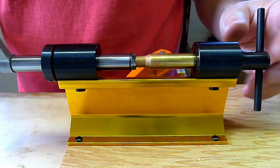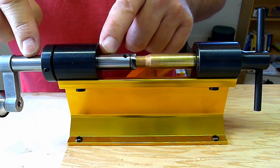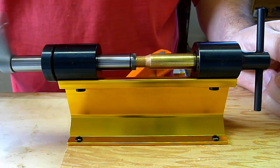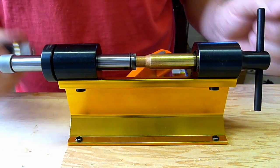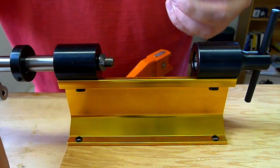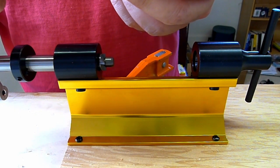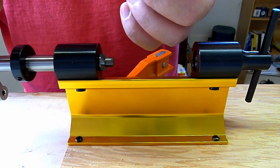Now, alright, this collar, which is locked on this shaft here, prevents this cutter from cutting like crazy into my case here, no matter how much I turn. So, it cut just a teeny tiny little bit initially, but very, very little. If I back this out, pop the case out of here, I had already adjusted my caliper to 2 15/1000 inches, and in fact, just the teeny tiny little bit that was trimmed initially is almost enough for this one to fit through.